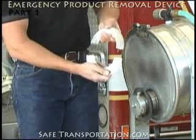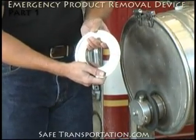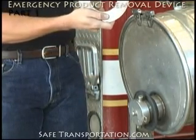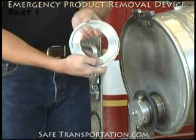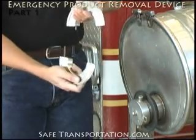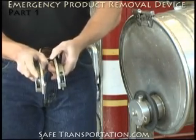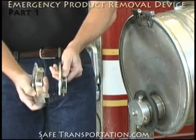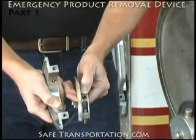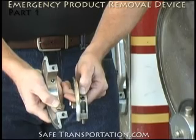When you go to put this together, they marry up quite nicely, and it's usually not that difficult because you have the guidance of the collar itself to get these things to join together properly. Now, these two screws that fit within each other — their job when you tighten them down on the collar is actually to compress the Viton gasket. Once those are tightened and you have compressed the Viton gasket, we have to come back to set screws that actually have nipples on the outside. You can see the inside of them right here — they have little points on them. We'll tighten those later, and when we tighten those down, they cut through the gasket right into the collar, and that is what secures the device on the collar.